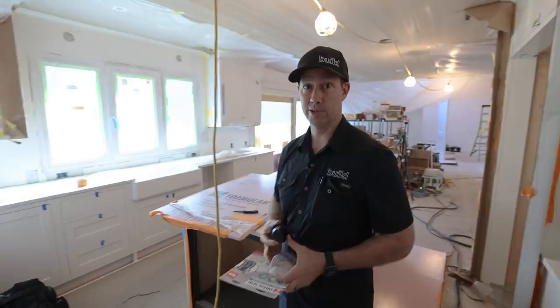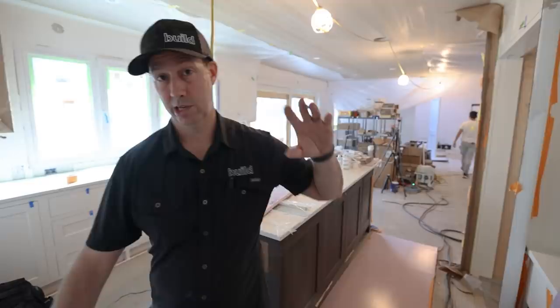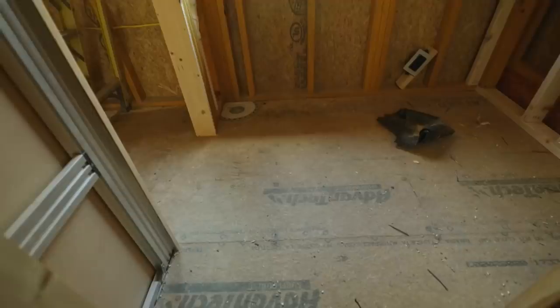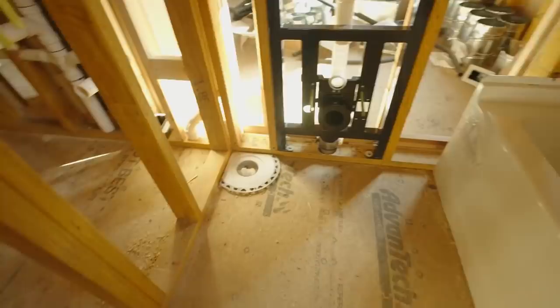With a little ounce of prevention, we could prevent multiple thousands of dollars in damage and the headaches that come along with floods. Check out my other videos - upstairs in my kids' bathrooms on my second floor, I put in drains in the floor so if my daughter overflowed her shower or toilet it would drain to a floor drain, with a marble threshold for a lip. In my boys' bathroom there's one by the toilet, and in my upstairs laundry room there's a drain in the floor as well. In this slab-on-grade situation, these pans are going to work really well - and these are not connected to my plumbing system, they just have P-traps and drain to the outside. If you're not currently a subscriber, hit that subscribe button. We've got lots of nerdy videos like this - I publish every Tuesday and every Friday. We'll see you next time on The Build Show.